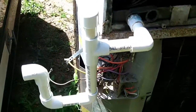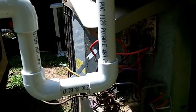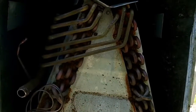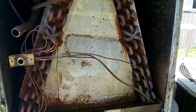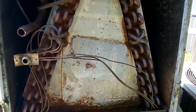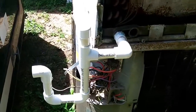That's the purpose of the trap. What I do when I go to put a system in is I actually make the trap. You can buy pre-made traps, but I have found — just by my experience — on the bigger units the pre-made traps get sucked dry because a lot of times the ductwork is undersized. Situations change: say somebody put a carpet over one of the returns by accident, or a kid dropped something on the return — now the unit needs return air from somewhere else, so it's going to suck harder and pull water out of the trap. That's why I prefer to make my own traps so I can make them deeper.